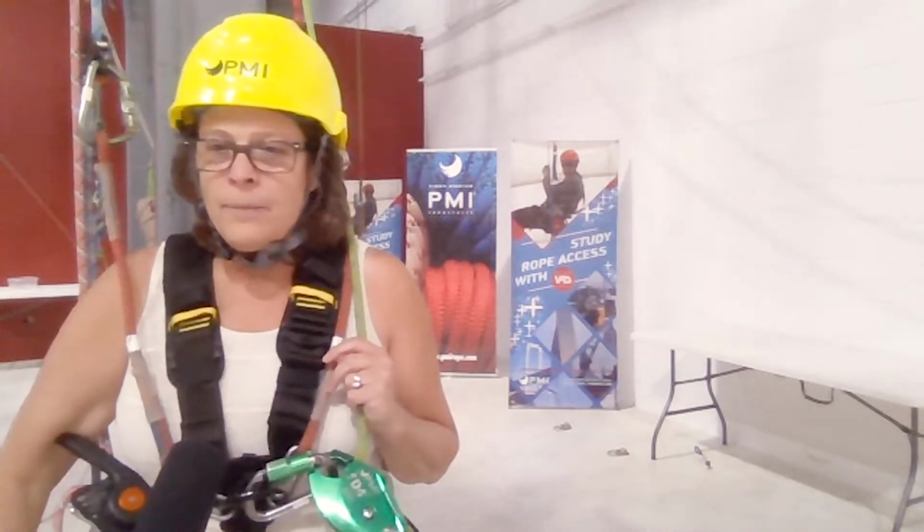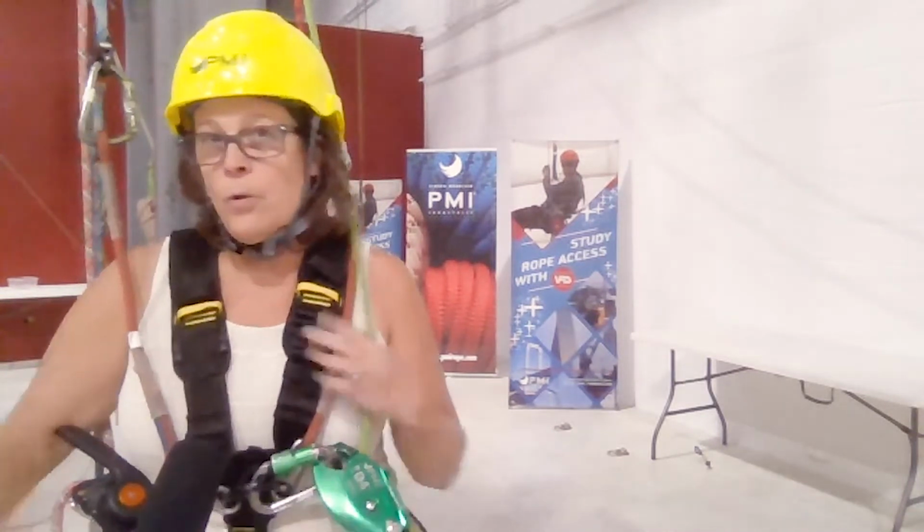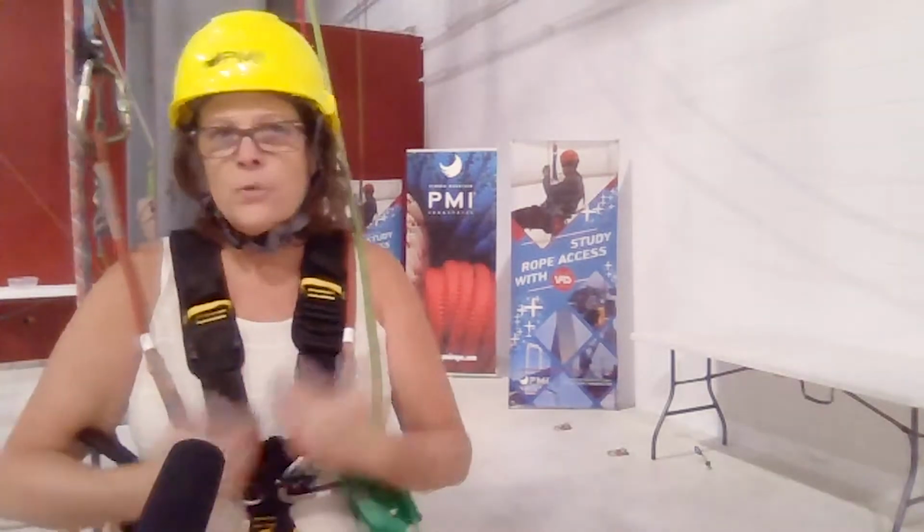Now, whether that's probable or likely or not, you're one technician, you're wearing one harness, where does this concept of redundancy begin and end? Yeah, that's a thing for sure. But where OSHA has decided to draw the line is at the connection to one point. There's kind of no getting around it. OSHA says what they say, and regardless of how you or I might feel about it, it's a thing. In fact, it's a regulation, meaning it carries the weight of law.